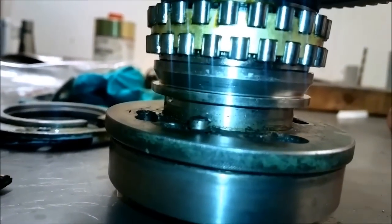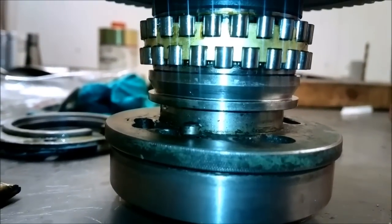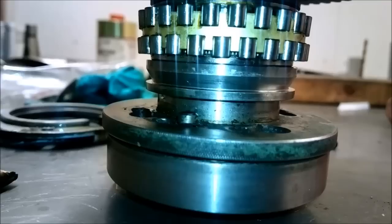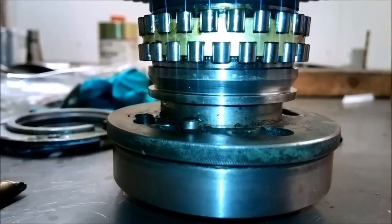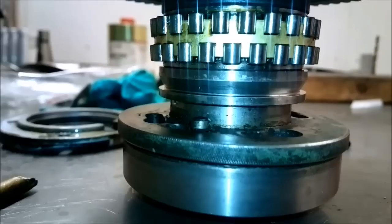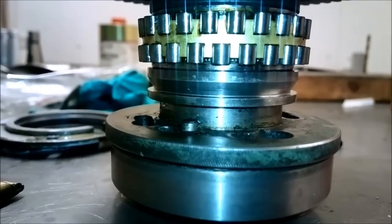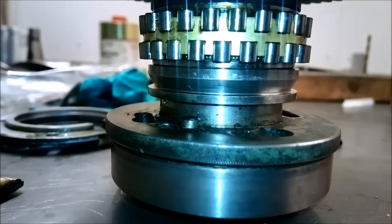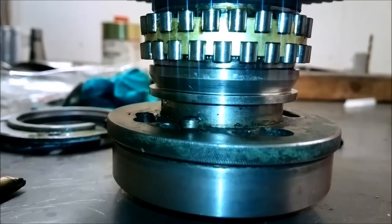And by the way, to my knowledge, the shim can't be too thin either, because what might happen is that the bearing will climb the taper somehow. I don't even know if this is possible, so if you know, please let me know what you think. But as far as I know at the moment, the bearing can climb the taper and make it too tight, and then lock and wear down. You have to be pretty accurate on how much you take off that shim. But if you think it's not possible for the bearing to climb, I will just take out like 1 millimeter. To me it sounds pretty amazing if it can climb. So what do you think?